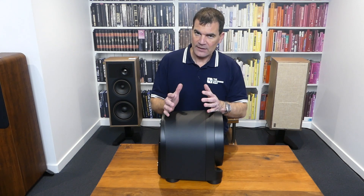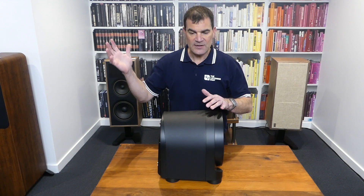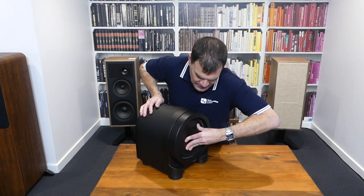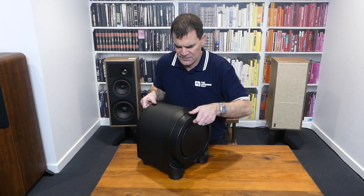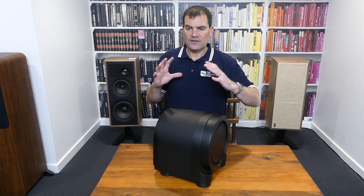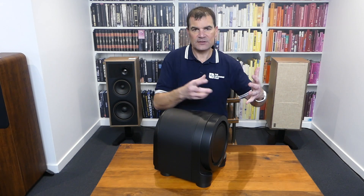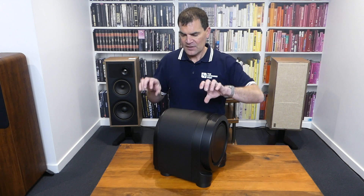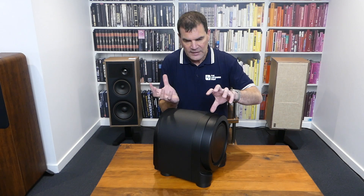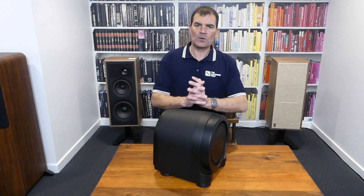What made some of this work so well — and these are design principles we now see in some of Paradigm's most expensive floor-standing speakers — is a dual voice coil approach. When you've got something moving a lot of air — look at that excursion, it's got to be more than plus or minus an inch — when it's all the way out from its excursion, less of the voice coil is inside the magnetic field. But by having two voice coils working in parallel, you end up dragging in more new voice coil as it pushes the old voice coil out. It's a really amazing principle, and to have seen this implemented in such a cost-effective subwoofer must have been a world first.